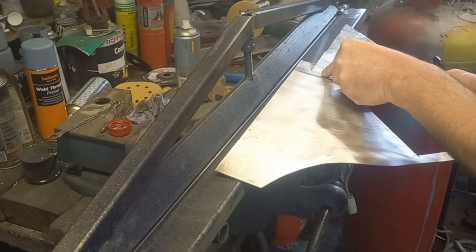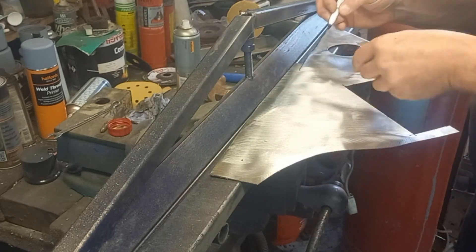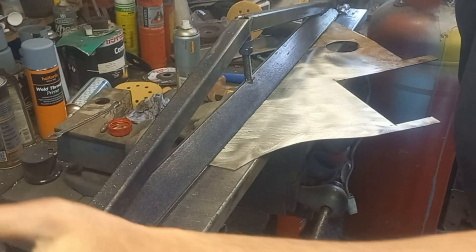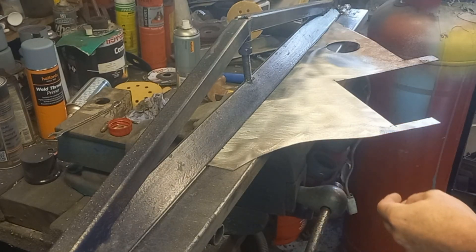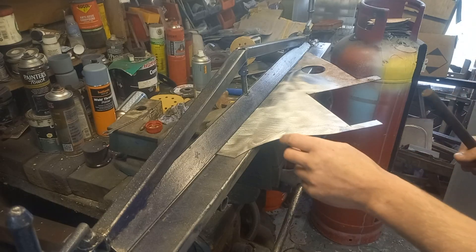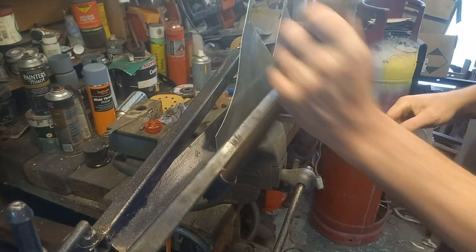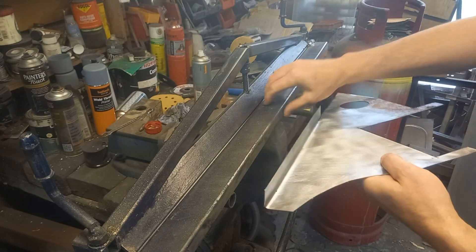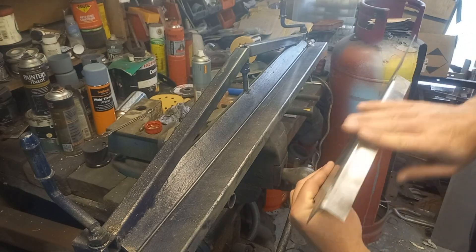I think what I'll simply do is just put a 25 mil bend on this and then work from there. That's almost 25 - yes, that's 25. I think this will give us the radius we're looking for as well, because I do need to strengthen this up a little bit. It is bending with a radius, but that's going to be in our advantage for this one. Let's get this bent up to shape and see what we've got. Yes, that's a reasonably nice radius bend in there - it tightens up in the corners but that's going to be perfect.